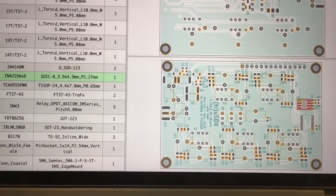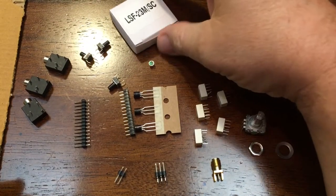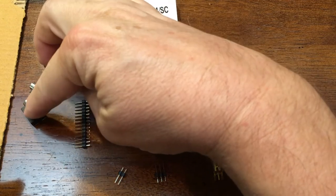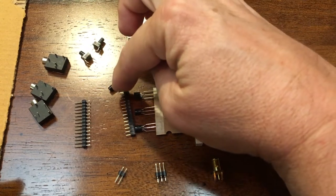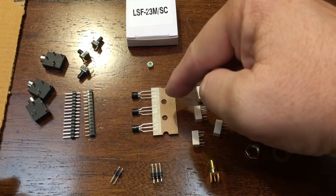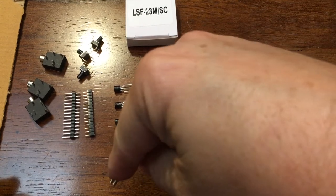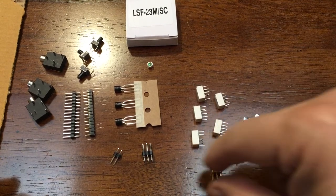Let's go take a peek at what goes into building the radio. Solder Monkey is going to walk us through these parts. We're going to start with the little speaker and the surprisingly good microphone. Three audio jacks — they only go on one way, so you can't screw it up. Same with the push buttons; there are three of those. The sandwich connectors to put the two boards together, the three MOSFETs for the control board, and this is a programming port — a set of leads.